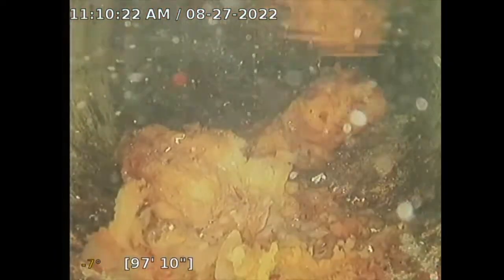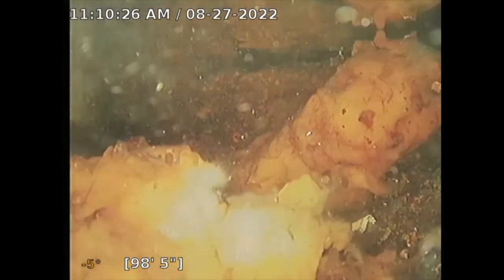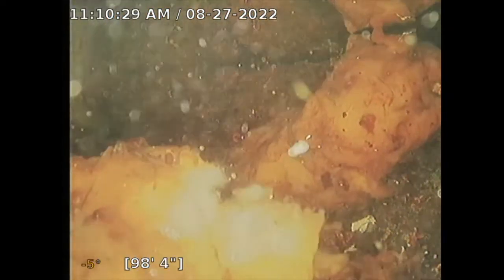Now with the water, it's a little tougher to push. So you got some backup here. And see, there appears to be a big tree root ball there. I'm not going to be able to push past that. So it's blocked. It's an obstruction. It's a good thing that we did this. So I don't know if it's a tree. Yeah, it looks like a tree root ball. It's like a little dam there. And you got some human waste there.